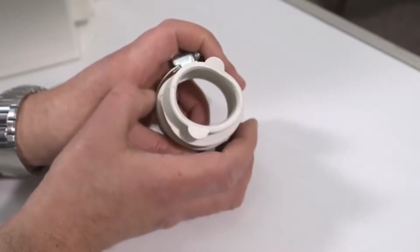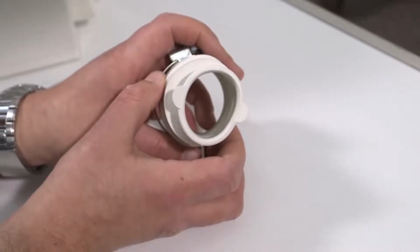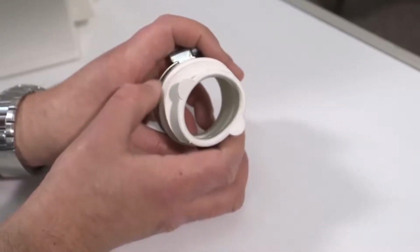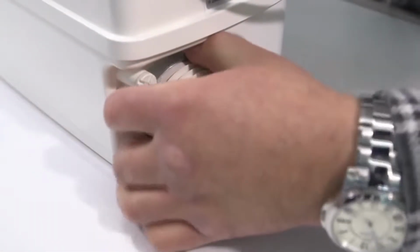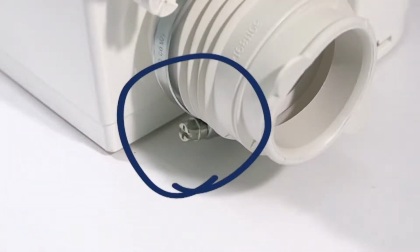The inlet pipe cover allows for some flexibility. Turn the connector to the correct orientation to allow the pipe the best possible position for entry. Next, fit the cover over the valve, but remember to tighten the Jubilee clip before the unit is put in place, as you'll be unable to adjust this later.